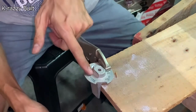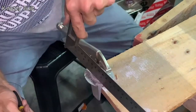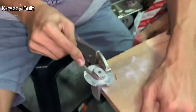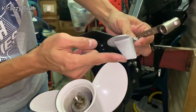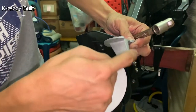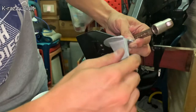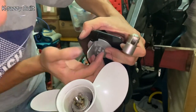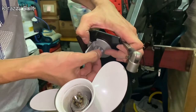Finally, after checking that the anode fits nicely in the mounting hole, let's install it. I need to remind you all that there is an orientation to install it. The fin that is slanted will be facing inside of the motor while the straighter side needs to face outside. This is because if installed inversely, the propeller will hit the anode fin.